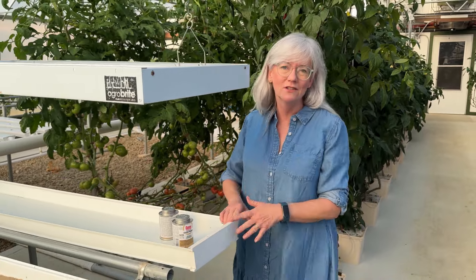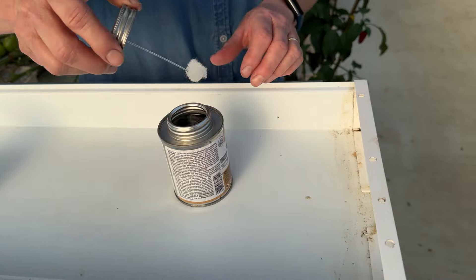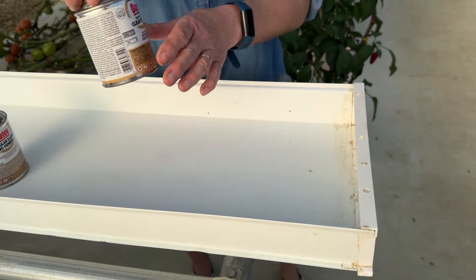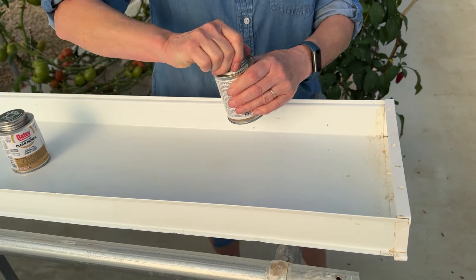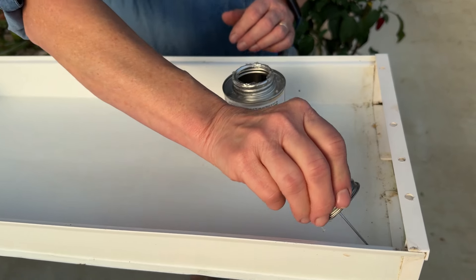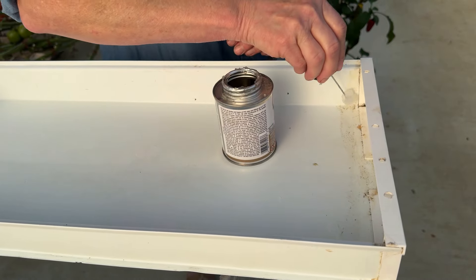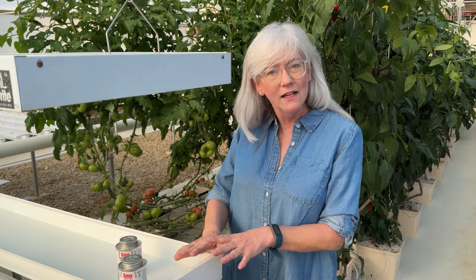To repair my channels — which I've been doing on all my channels because after nine years you get leaks — I found that if I use my cleaner primer first, use the clear stuff, not the purple stuff, dab that in there and get it all cleaned up, then put your cement in there — the glue — and it will get into all the crevices and seal it up really good. I'm going to let that dry overnight and then tomorrow come back with a little bit of caulk and make sure it's really sealed up with no leaks.